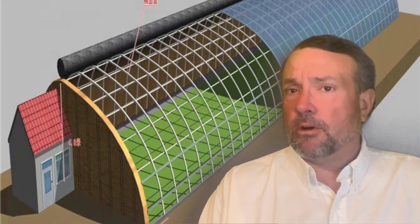When you think about a greenhouse, it's got some sort of a transparent material that keeps the plants warm. If you have a single layer of transparent material — whether it's single pane glass, polycarbonate, or plastic — there's almost no insulation value to that. It comes in at an R1, maybe even less, maybe a 0.5 or 0.2 depending on the material.